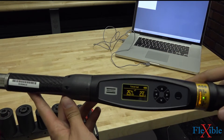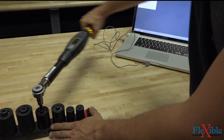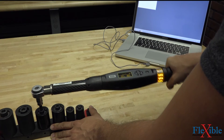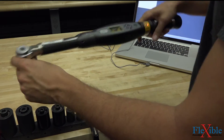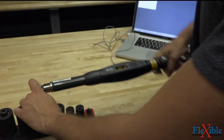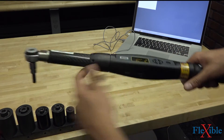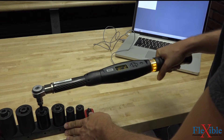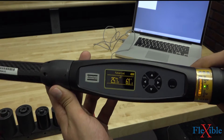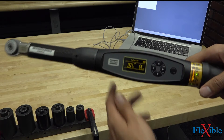The first bolt came in at 25.62 Nm, 23 degrees. On the second bolt, we went a little over on the angle — I had an angle maximum of 200, but I exceeded it because I loosened it way too much. I could fix that by either increasing the maximum angle or just by not loosening it as much. So now that we've reset, let's try tightening this bolt again. Now we've got 25 Nm, and this time it only took 61 degrees since I didn't loosen the bolt too much. Since they're very different joint types I should have different PSETs for both of them, but for the sake of this tutorial we'll just use one.